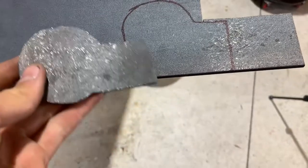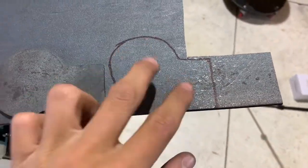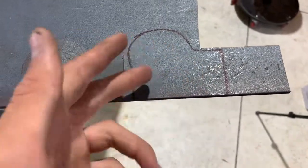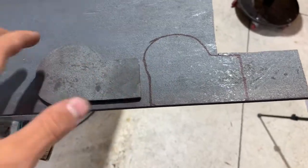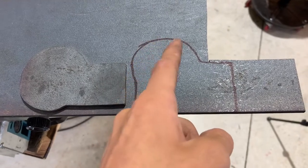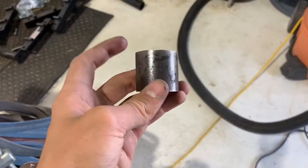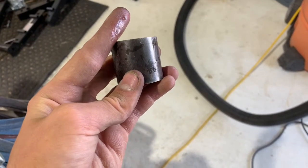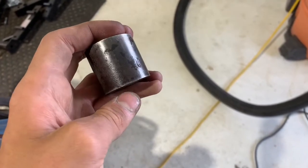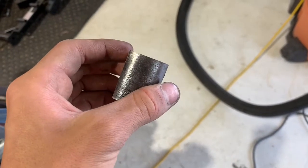All righty, so I've chosen to skip this piece and I'm going to go for this as the base plate. It's more in shape — more like what it would actually be shaped like. This one will have exactly a quarter inch around on all edges. So I'm going to cut out that one. Next I need to grind a 45 degree bevel on one side and then a 60 degree bevel on the other side. So time to go do that.